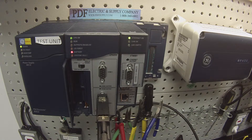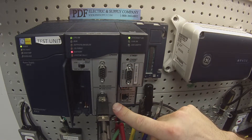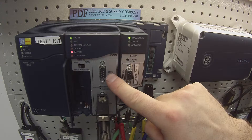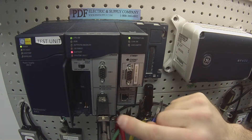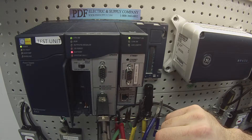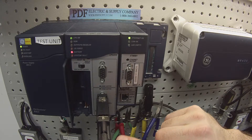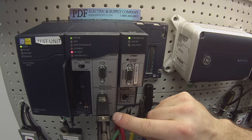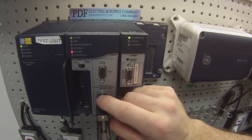The cable I'm using for this test allows me to switch adapters so I can go from COM2, which is a 15-pin port, to COM1, which is a more typical 9-pin serial port. The cable is an HE693CBL232 and the connector for COM2 is an HE693SNP232.